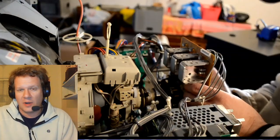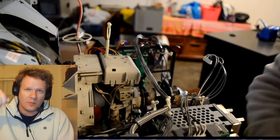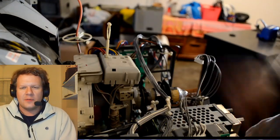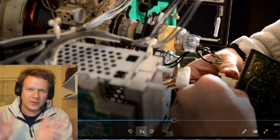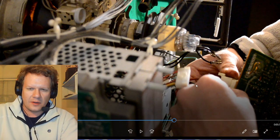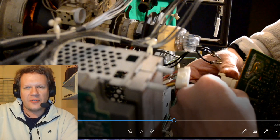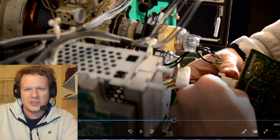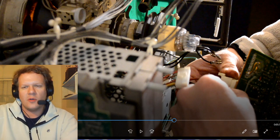You should also discharge the tube spot with a discharge tool after doing that. The reason behind doing it in that method is you're not going to damage the back of the tube by scraping it with a screwdriver, which was apparently a problem where untrained techs would go in and scrape that tube too hard and actually damage it. Next, when you're removing the neck board, you'll notice there's a piece of plastic that holds the neck board in place that is so brittle from the heat of the CRT gun that it will most likely shatter just from touching it. Don't worry — you can get some silicone and reapply it.